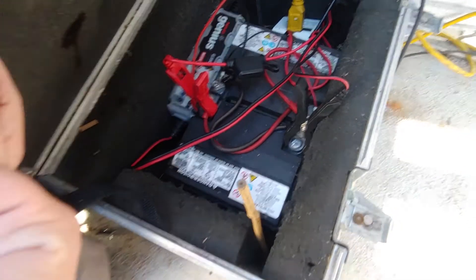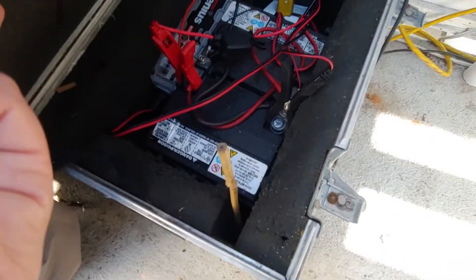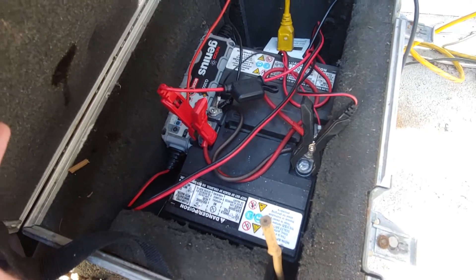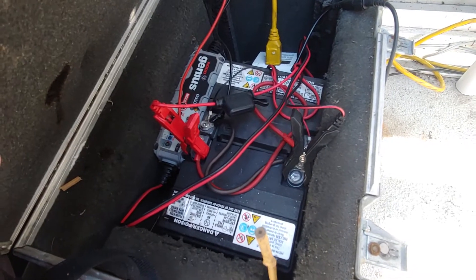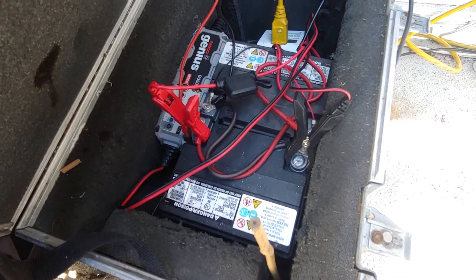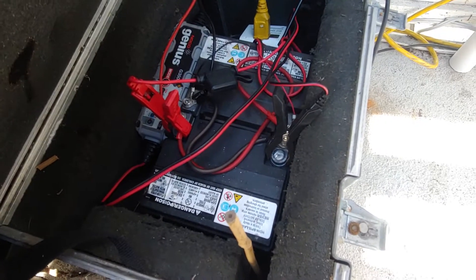That was an elaborate explanation, but it's very easy to do. These are two 12-volt Harley-Davidson batteries, which are pretty big. The part number is YIX30L — that's the Yuasa number. There's a 30L, 30LBS, a whole bunch of them. But I wouldn't buy a new one. I would take a used one or prefer some sort of small deep cycle boat battery or an old car battery — anything that doesn't have a lot of cranking amps would still work fine for this sort of small pump.